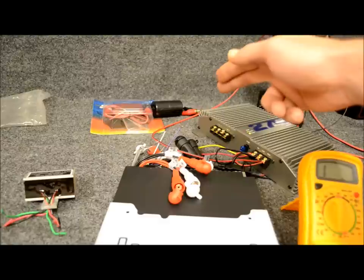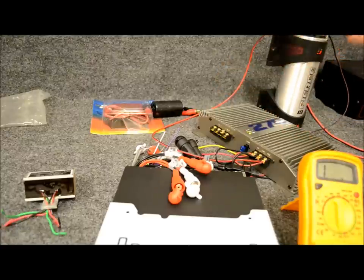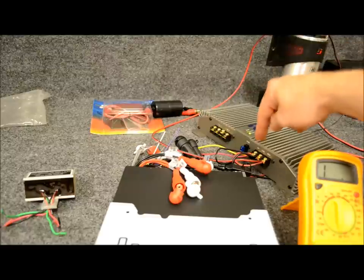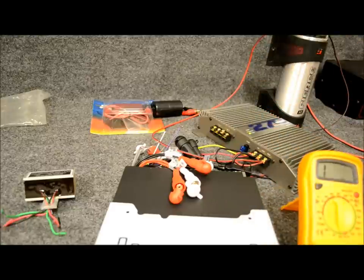So the right way to fix it is to get all these grounds to be equal. Without cheating and going for the band-aid — the ground loop isolator — because I know that would fix at least half the problem, but half will remain. And I've seen those things work for a little while and then start acting up again later on down the road. Don't do it. Do it right. Take your time. The best way is: connect the ground from the head unit, run it with your amp kit to the back, ground it there, make sure each component is grounded to the same point, and make sure you're using appropriate size cable so you're not getting signal loss along the line. The longer the wire runs from point A to point B, the thicker the gauge needs to be.